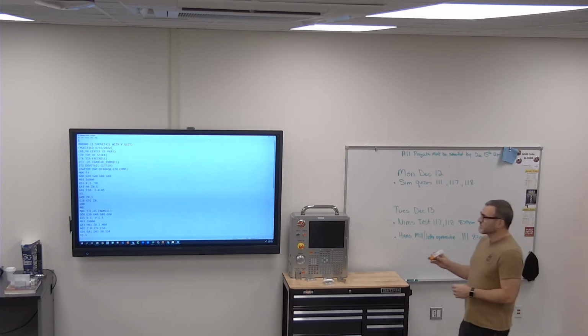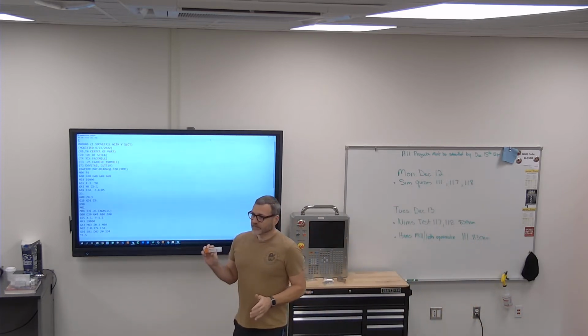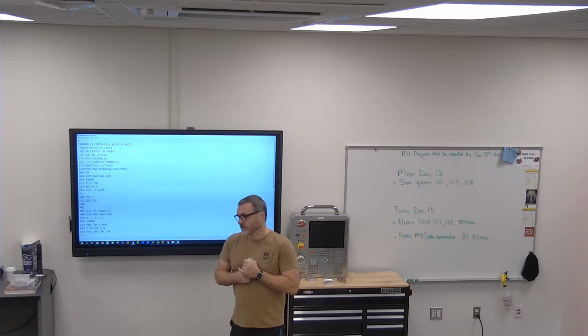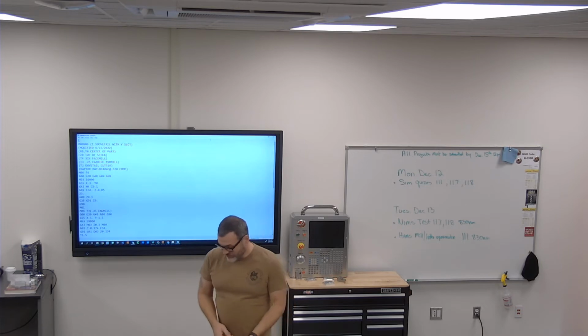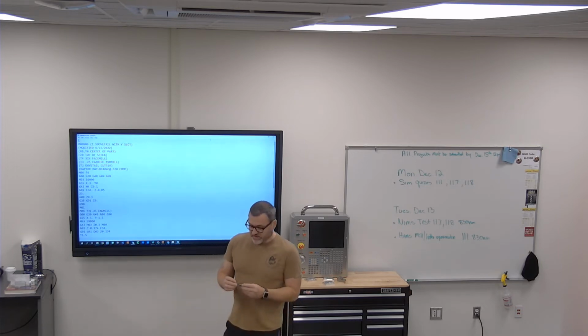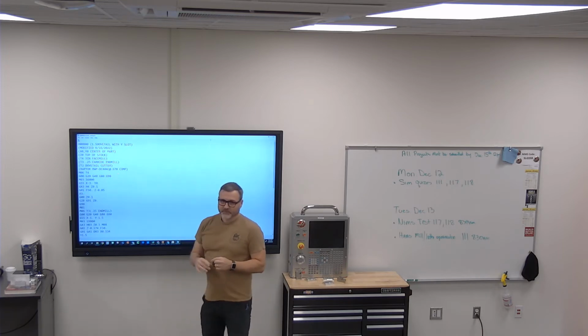So it says specifically what end mill you're supposed to use. You have to use that end mill. It's got to be one of these Raptor end mills. Now, not that this is the only kind of end mill that can make a dovetail, but it is the particular dovetail that works with this diameter comp.